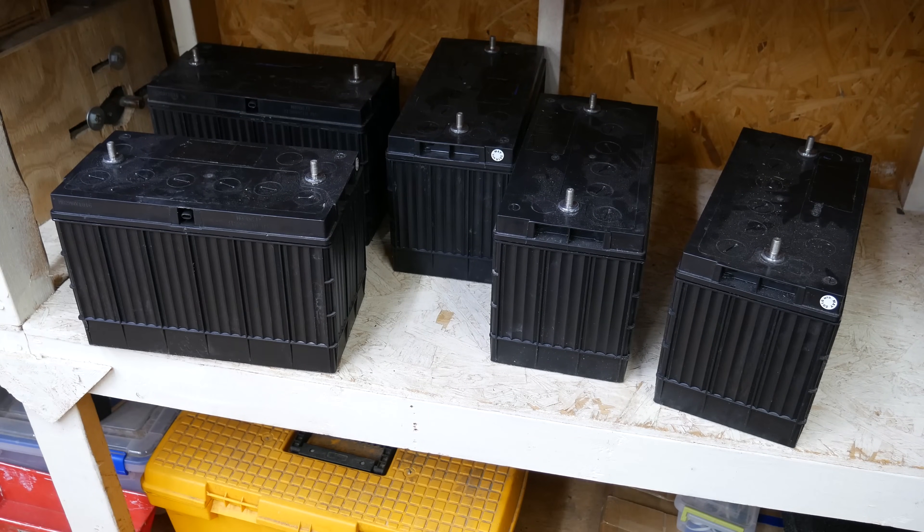Let me show you the batteries. These are 100 amp hour deep cycle batteries — lead acid — and these are the batteries I've chosen for this project. There are many different options; I chose these because they fit my price range and the power delivery parameters I need. But there are gel batteries and lithium batteries, which are lighter and more expensive. They can be discharged more deeply, which actually brings me to the final term: DOD, or depth of discharge.